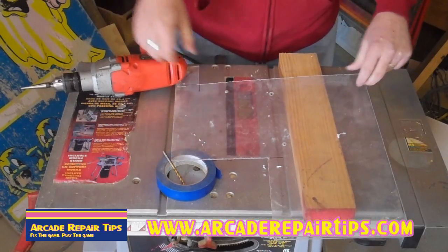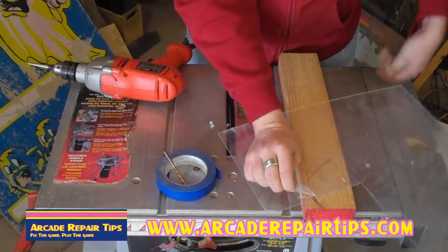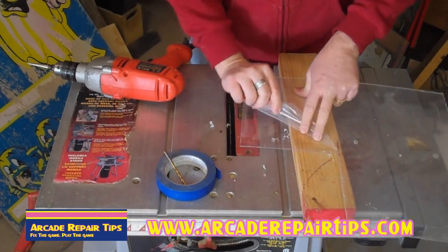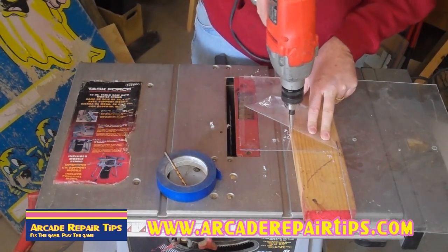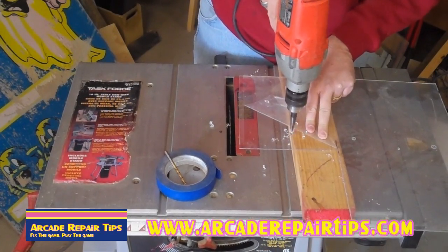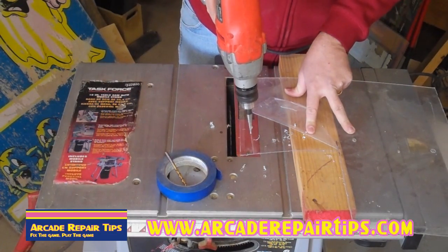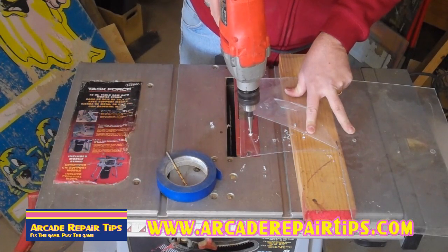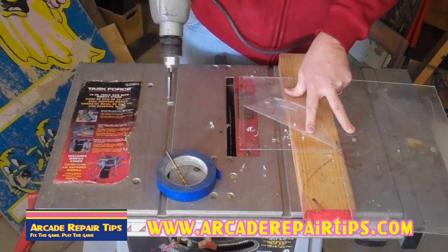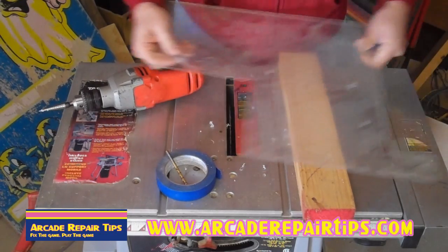You may also notice that I left the film on the plexiglass here. Always leave that film on when you're drilling — that helps. But even with the film off, which is more likely to crack, I won't have any problems with just that drill bit. Here's one I dare you to try with a regular drill — I can go way out near the edge and drill without cracking. Even with the bend of it and everything, I'm not cracking that. And that's pretty neat.